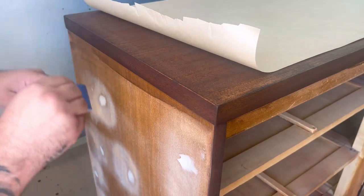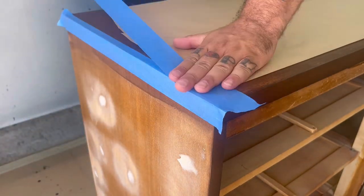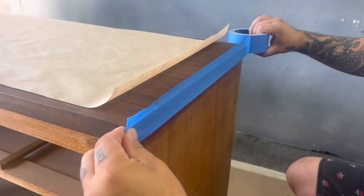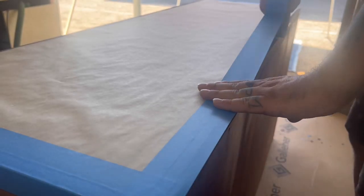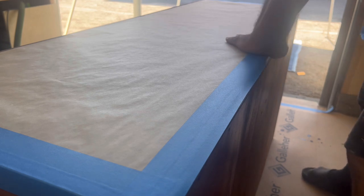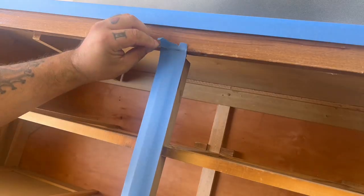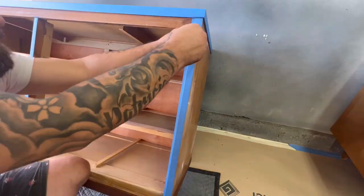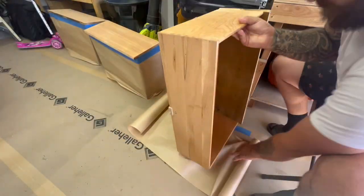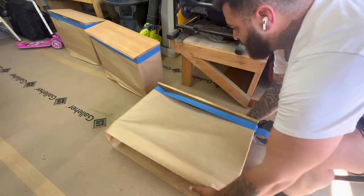When covering up stained areas that haven't been finished yet, you really want to give it enough time to dry. If you try to apply tape and paper too soon, the stain soaks into the paper and tape, and I've had issues where I remove it and the color is off — then I have to restain it and let it dry again, adding a couple more hours or even an extra day to my work. I'm taping off and masking all the stained edges and using a razor blade to score and trim off the excess so I get a nice crispy line. I'm masking off all the drawers with paper and tape — I'm sure there's a faster way to do this but this is what works for me.